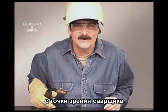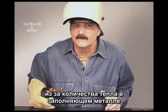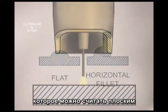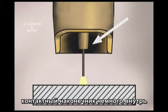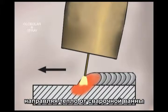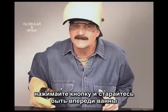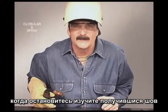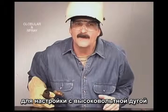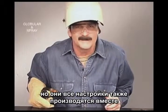From the welder's point of view, these are similar, and while it is high speed welding, it's also very simple. Because of the amount of heat and filler metal, these are generally used only in the flat position or for a horizontal fillet, which is basically flat. The contact tip should be slightly recessed and use a longer electrode extension, around a half an inch. Angle the gun slightly to push the weld, directing some of the heat away from the molten metal. Aim the wire into the joint, pull the trigger, and try to stay ahead of the weld build up. With the higher voltage open arc, you can no longer use the sound to adjust the voltage and wire speed settings, but they still need to be tuned together.